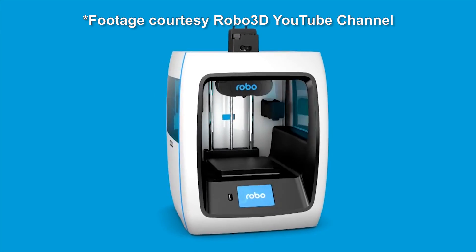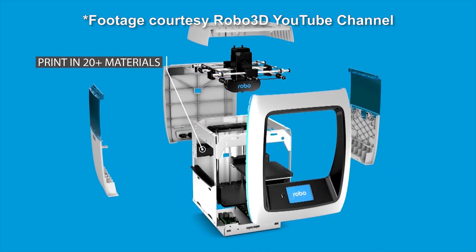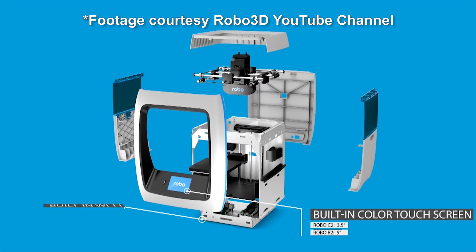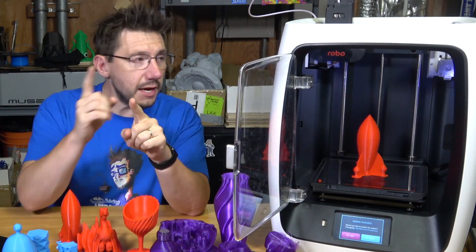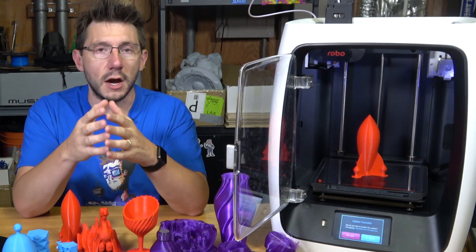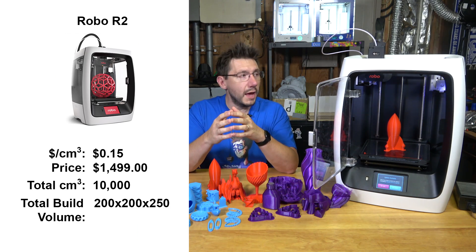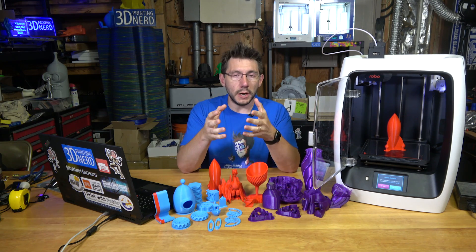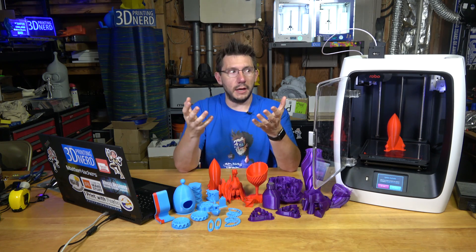Let's talk about the things I like about this machine. It's solid — this machine is solid metal under its plastic housing, very sturdy and very rigid. It's also got wireless printing because it's running an OctoPrint server with a Raspberry Pi inside. From an app or from a website you can print to the Robo R2. There's also a camera inside so you can keep track of your prints or record time lapses. The R2 has a build volume similar to the Prusa i3 Mk2, and the kinematics up top with the dual bar for X and dual bar for Y are similar to the Zortrax M200 and M300 machines.